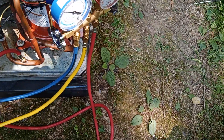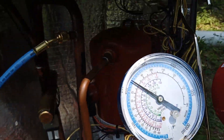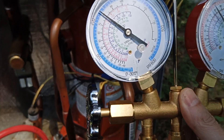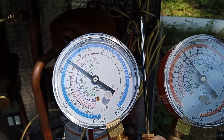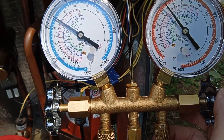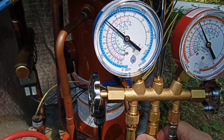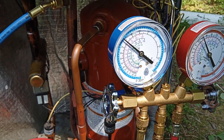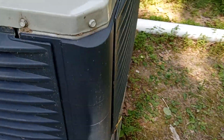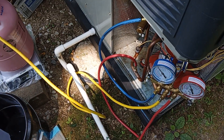It also raised the pressure up to about 234 — still quite low, but it's the same on both sides of the compressor, so there cannot be any kind of over-pressurization on the compressor. It doesn't take very long for that pressure to propagate through the system — in theory it's instantaneous — so there cannot in any case be an excess pressure on a compressor inlet.